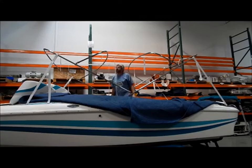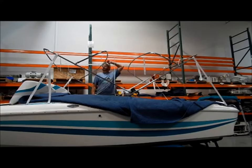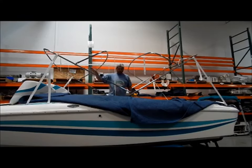Ready to lay some fabric across the top and get to marking. Two fingers, looks good at the front and the back. We've lowered the nose of the trailer to put the boat at more of the attitude that it sits when it's in the water. We checked with the boat owner and he said this is about the attitude it sits. So the Bimini top will be nice and flat when it sits on the water. So, let's get some canvas and get to fabricating.